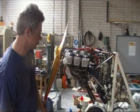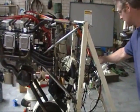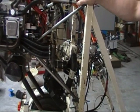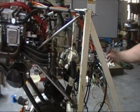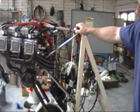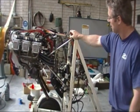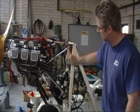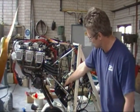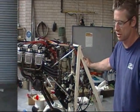So we haven't run this yet — we've actually just finished it. I'll fire off the pump. It's pretty quiet, so we'll turn our master on and the water pump's going on now. You can just hear it burbling away. On the test rig we'll just have a switch to turn it on and off, and we'll experiment with temperatures to see what it does when the pump's on and off — whether the pilot needs to leave it on full-time or can leave it off for warm-up. Ultimately we'll probably put a thermostat switch in there that, using water temperature, will switch the electric pump on and off. In case that switch fails, the pilot will still have an override switch so he can manually turn the electrical pump on.